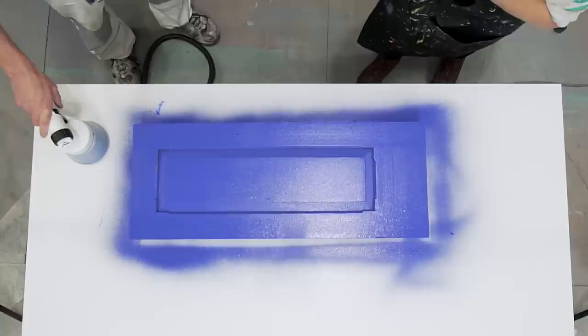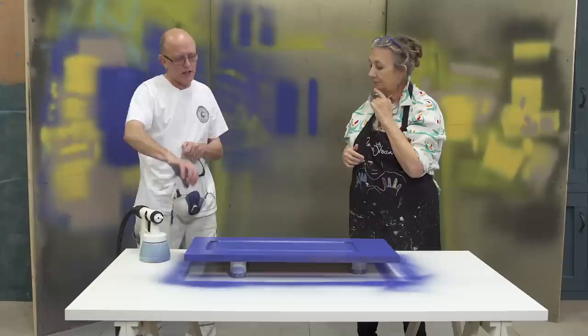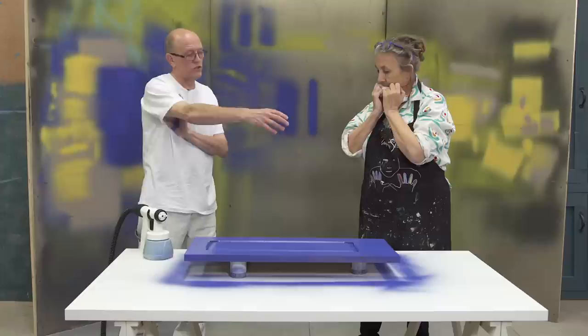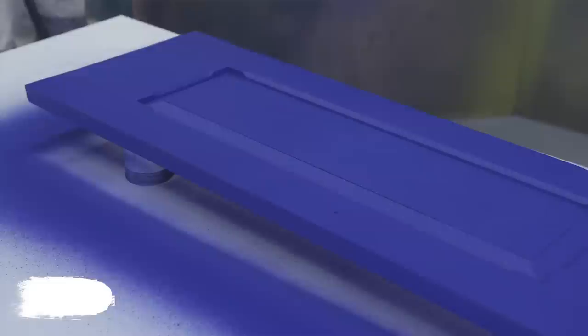For some of you sharp-eyed viewers, you'll see that actually this is quite stipply — it doesn't look completely smooth. Because we've thinned it, that paint will settle out. It has gone a little bit stipply, but as the paint tightens up it will go back completely smooth. For the second coat — do you need to wait for it to be completely dry? I think you'll be looking at about an hour for the second coat. If you put the second coat on straight away that would be okay, but once the paint starts to dry you'll get different finishes in different areas.